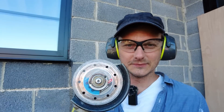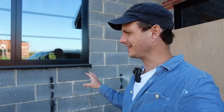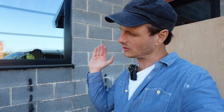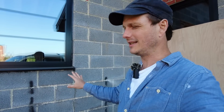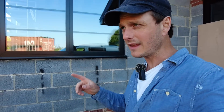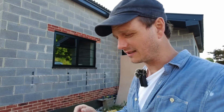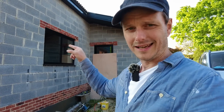If you were doing this with brick instead, you'd probably want to replace any cracked bricks and go 40mm deep to leave room for mortar in front. I went roughly 30 to 32mm deep. I reckon that will sort it — fingers crossed. For the expanded metal lath, I'll probably fix it around with concrete screws — that's going to happen way in the future, so make sure you subscribe and hit the bell notification. The question is: do I do a similar thing on the inside just in case?